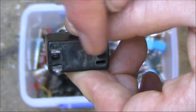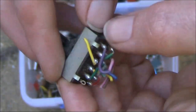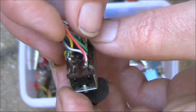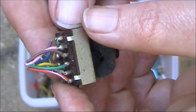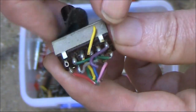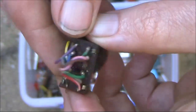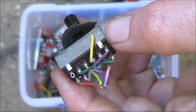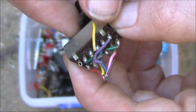So that would have at least four and possibly six connections. This is another slide switch with only two positions, but there are a lot more connections than normal — it looks like twelve. So that very likely means there would be four switches in this, all controlled by this one lever. But you don't know 100% for sure until you test it with a multimeter, because there are different switch configurations — like switches that short out rather than open — and all sorts of things like that.